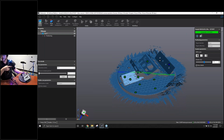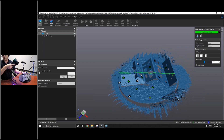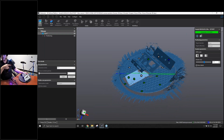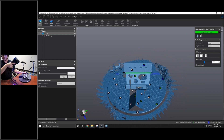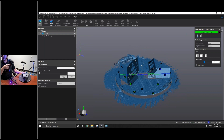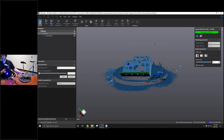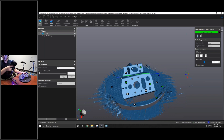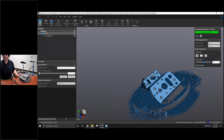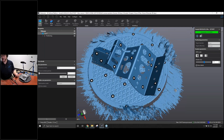Once I gather enough data for an initial amount, I can double-click the scanner button to switch to a single line laser mode. The scanner is a blue light laser at a pretty high frequency, but this single line mode is very intensive and specific. You can see data that maybe didn't come in at first now starts coming in as that line goes over it. We can use these two different methods — gather large swaths of data with the grid, then use single line mode to really focus in on thin edges, making sure edges are captured properly. As I go over different parts of this flange in the single line mode, it's gathering a lot more data that didn't get picked up at first. I can also place this on its side to get more data, just making sure I have a couple of targets in view at all times so I don't lose tracking. This scan looks good enough, so I stop the scan.